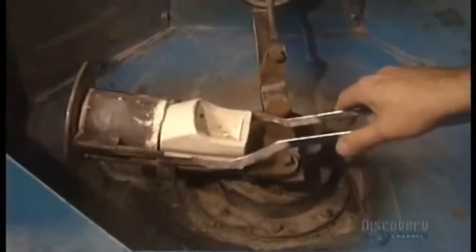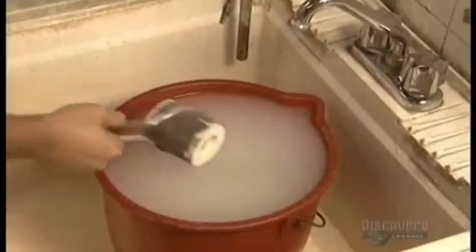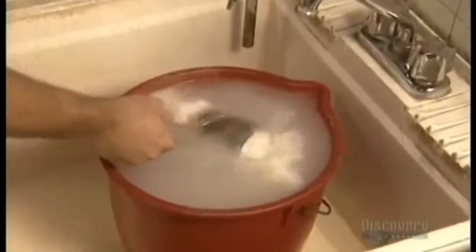The machine spins for about a minute. The centrifugal force shoots the liquefied gold into the plaster mold that's inside the cylinder. The jeweler then immerses the cylinder in cold water. This cools the gold and makes the plaster disintegrate. What's left is the cast gold ring, but its surface is rough.